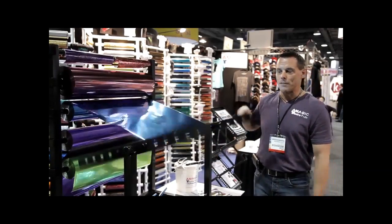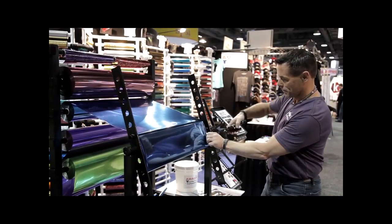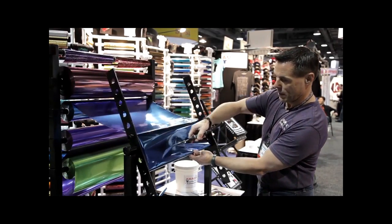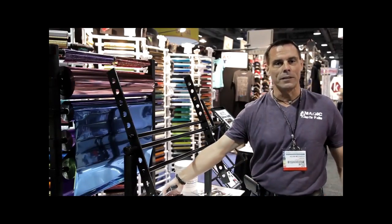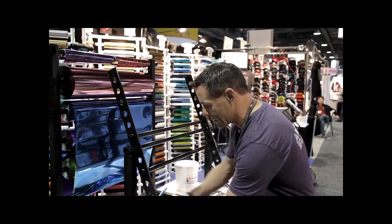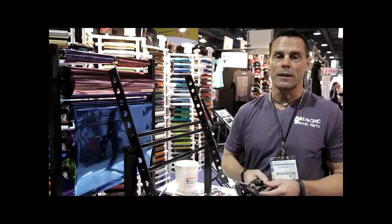Let's say I crank this 50 times — that would take me about one minute. I grab my scissors, I cut my sheet, and I have 50 sheets now cut at 14 inches of length. If I needed something about 4 inches in strips, I would just cut again and could get maybe 5 out of that. I've got 250 sheets in about 30 seconds.